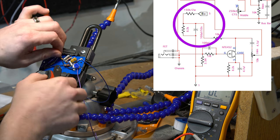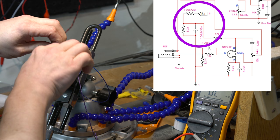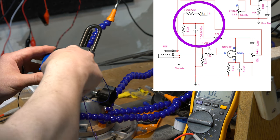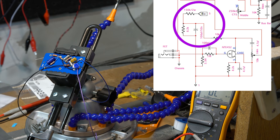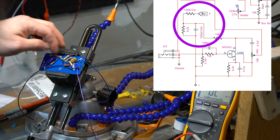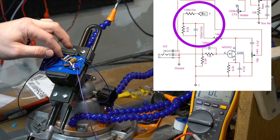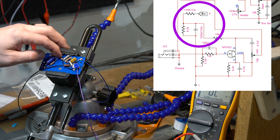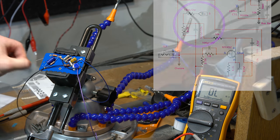And then I'll pull this up and carefully find a way to snip it as well. There we go. That was kind of silly. I'm seeing now, if we look at the schematic, all of those points of the high voltage come into the 8K resistor, the 100 microfarad capacitor, and then there's a 10K jumper from there over, but everything else goes to ground. So that was unneeded. I'll fix that now.